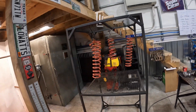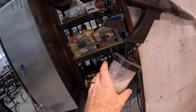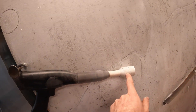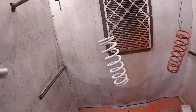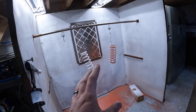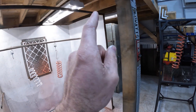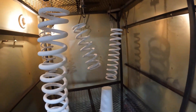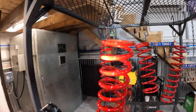Now that they've cooled down to 100 degrees or less, I've filled up the vortex hopper with the Vision Clear from Prismatic and put the multi-coat nozzle on. We've already coated one — it basically ends up looking white like snow when you've got it coated properly, about two mils thickness. Back in the oven at 375 — at that point it's a full cure based on part temperature at 375, about 18 minutes.